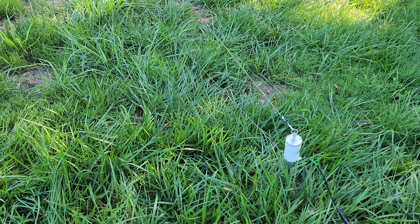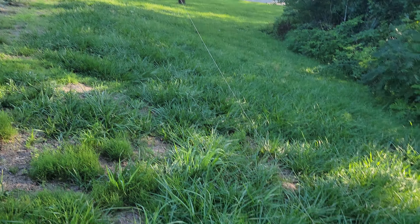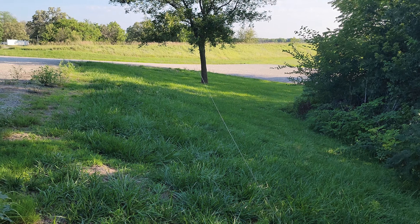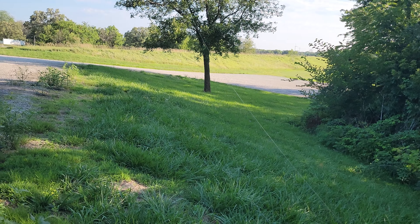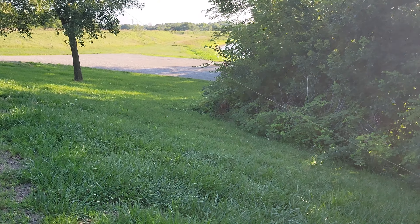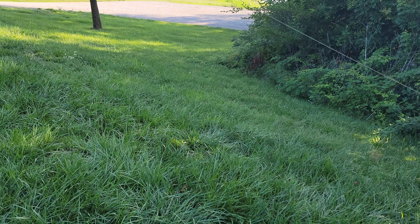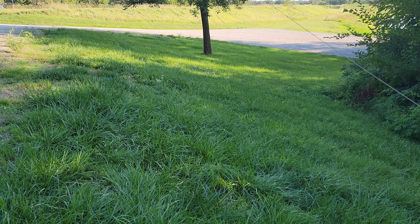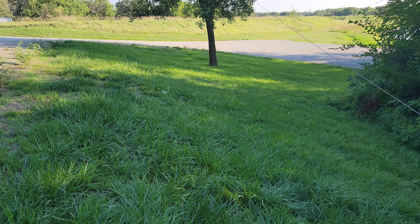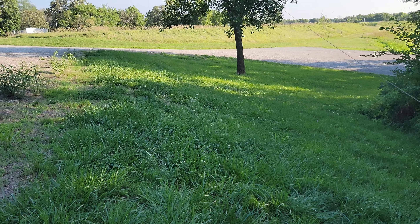And if I remember right, you're supposed to have the counterpoise running in the same direction as the antenna itself — I could be wrong on that. I checked my SWR with my RigExpert Stick Pro and it's a little high. My 7300 will definitely tune it out without a problem, but I was sitting right at about 2.9 on 40 meters, about 2.3 on 20 meters, and 17 meters looked to be about the best.